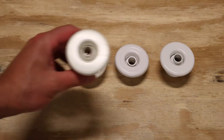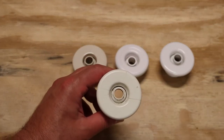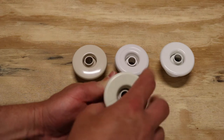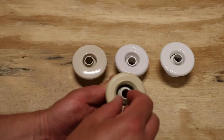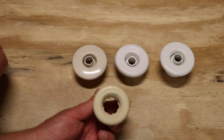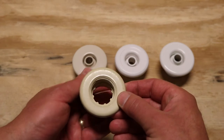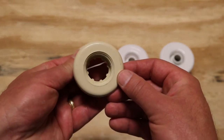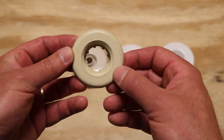The first jet we're going to look at is a jet that was made by HydroDynamic. This jet is now discontinued. We do have a replacement for it, and I do have a separate YouTube video explaining this jet. But how do you know if you have this jet in your tub? Well, it's very, very simple. Once you take off the flange and the eyeball and the dirty old O-ring that's behind it, you're going to notice a notch pattern deep down inside that jet. This jet has eight notches. Let me just hold it up to camera so you can see — eight notches in there spaced out accordingly. So once you take your jet out and you look at the notches on your tub, if you have eight notches like this, you have this HydroDynamic jet.